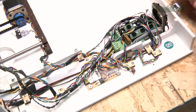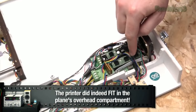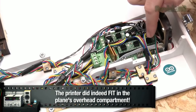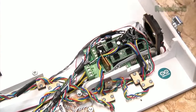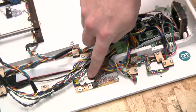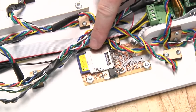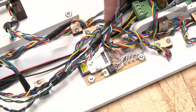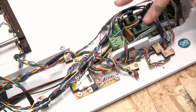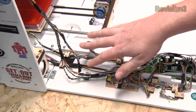Here's the bulk of the wiring — in retrospect I would have done this differently, but oh well. Here's the RAMPS board — it's the same kind of board we used on the first 3D printer. It has the four stepper motor drivers, and underneath it's an Arduino Mega 2560. Here's the SD card we talked about — basically you can use this as a file system and pull G-code files directly off this to run on the machine, so you don't even need a computer. All these wires go to power the heaters and drive the stepper motors.